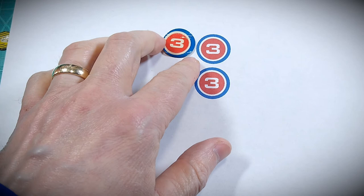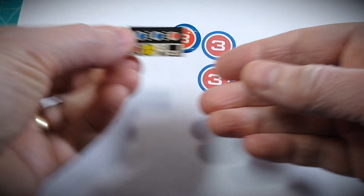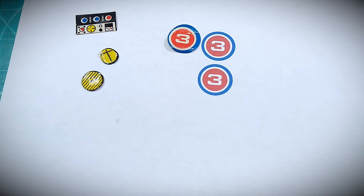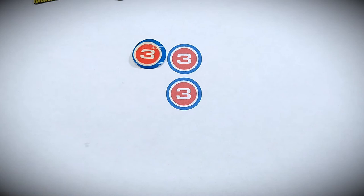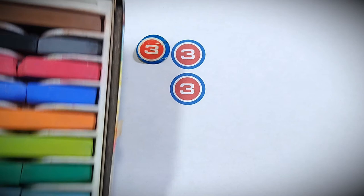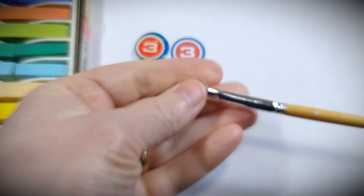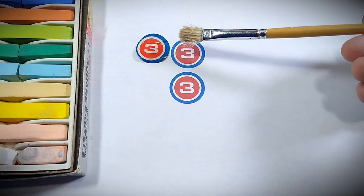This flaking in the print is something I'll be touching up using acrylic paints. The vibrance of the original compared to my inkjet print isn't as strong, but I'll be putting a spray sealer over this and that will help boost the appearance. My original decals are all prepped and ready. My reproduction one is on fairly bright white paper compared to the vintage ones, so I'm going to tone that down a bit with some pastels so it doesn't stick out like a sore thumb. I'm applying the pastel using a coarse brush, working it onto the brush and then brushing it over the whole surface.